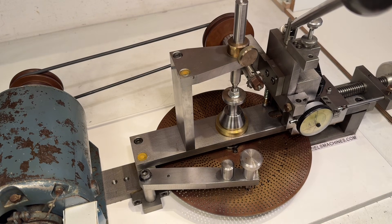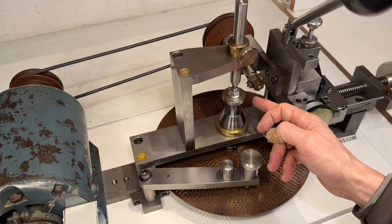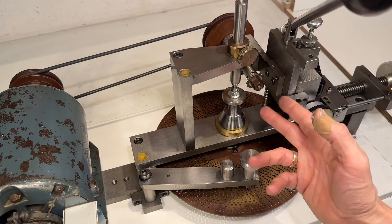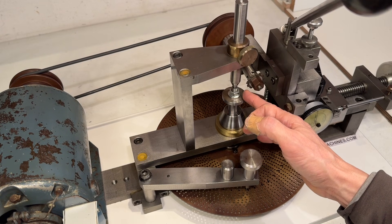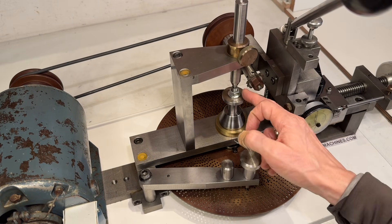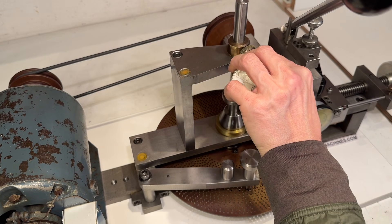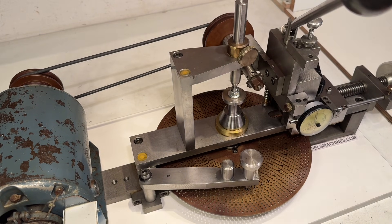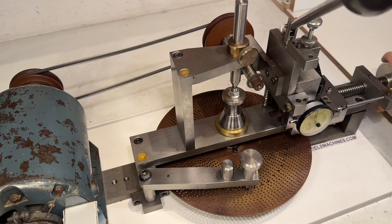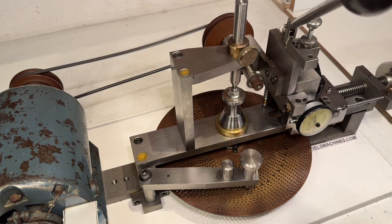Without the experience I don't know if that's bad or good, and I also don't know how many cuts I'm going to make — can I do it in one? I decide first I will go in every time half a millimeter, so three cuts for one tooth. Let's have a go. I have a little bit of cutting oil here which I will put on. So let's go in half a millimeter and see what happens.